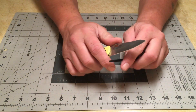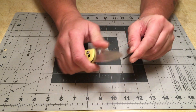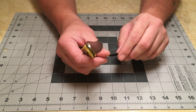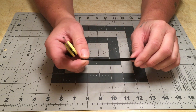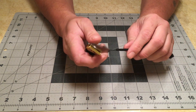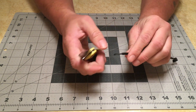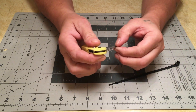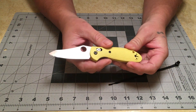Some overall thoughts and impressions after my first use. The 220 is very porous — water just goes right through it. It is a very fast stone, as you'd expect any 220 grit to be. It is friable, and the grit that comes off is sandy. It has a sandy texture — not a super muddy stone, just a sandy, gritty kind of release.